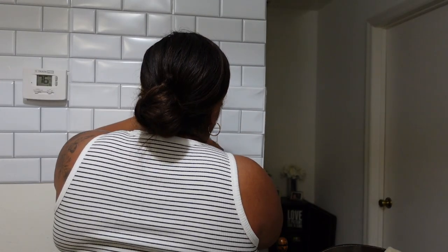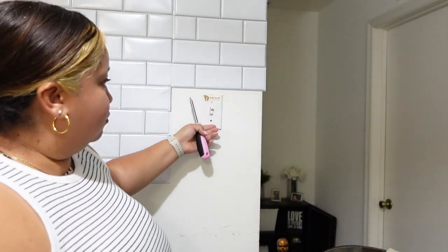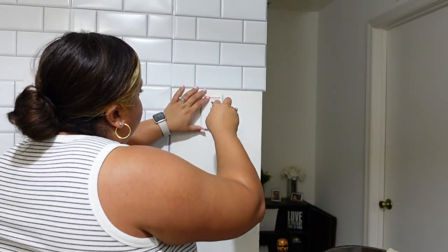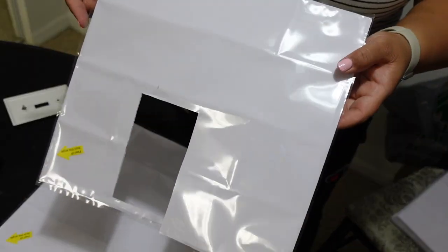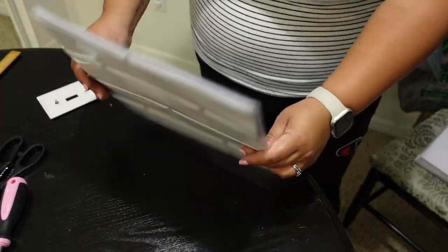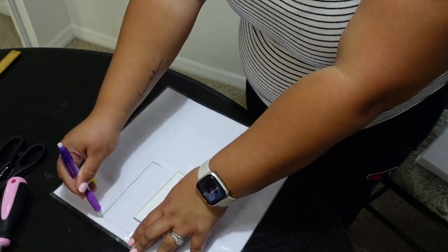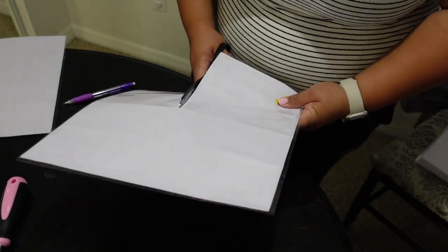With these projects, there's always going to be mistakes. One lesson I will share: be kind to yourself and let common sense flood in. I thought, let me take off the cover and measure it — should have done that before, right? Don't judge me. Got the cover off, measured it correctly, and now I'm double checking to make sure. I ended up taking the original piece I cut and put it on top of a new tile, put the cover on to measure, and then recut the next tile. Don't make the same mistakes I did. If you're going to use this type of peel and stick, most outlets you can unscrew them and just take them off so you can get an accurate measurement.